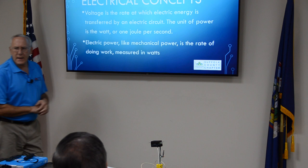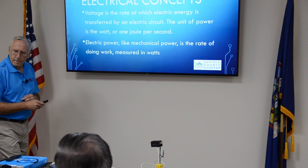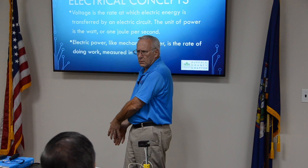Okay, any questions on that? Watts. Watts is what you're paying for. Watts is where it's at. That's the amperage. That's the current. That's the heat. That's what you're paying for. Okay? The difference between volts and amps. Volts and amps. Okay, let's go back to that water, that pressure washer. The pressure washer, 3,000 PSI, right? Mm-hmm. But what, a couple gallons of water? So high voltage, low current.